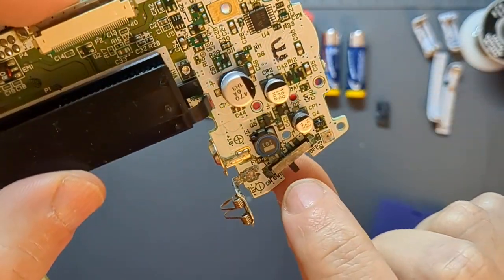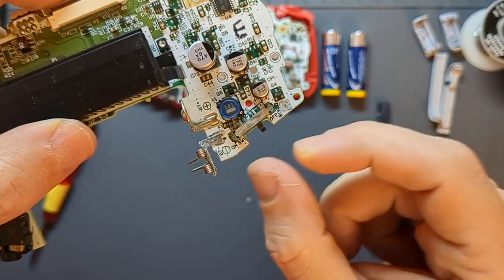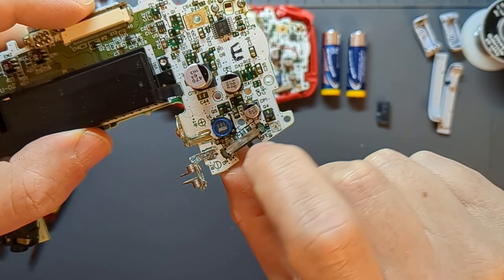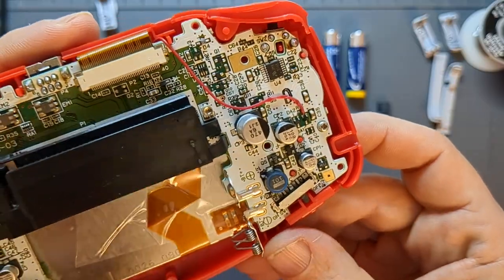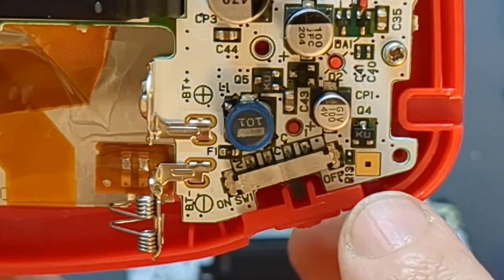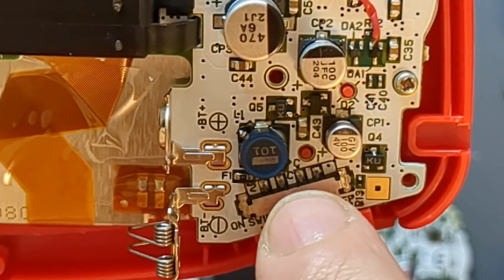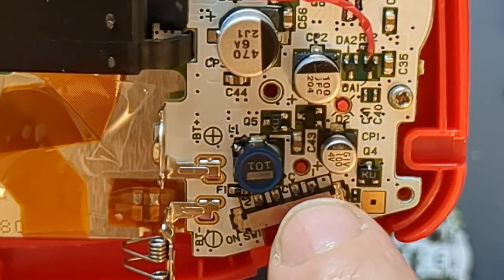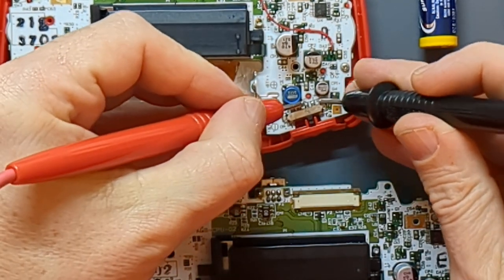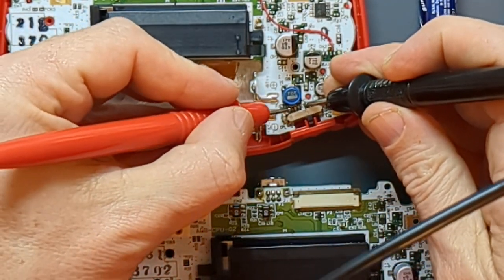What I'm looking at is that the switch has got a number of contacts that are very corroded. When you switch on or off, it either connects or disconnects those. It feels like a lot of the corrosion is inside the switch, in which case I might need to dismantle it, clean up inside and put it back together. On the switch there are four solder points - one on each side and two in the middle. The two in the middle are connected. When it's switched off, those three will have continuity on the right; when switched on, the ones on the left will have continuity. Testing with the multimeter: middle to right connector works, but middle to left connector - nothing happens.